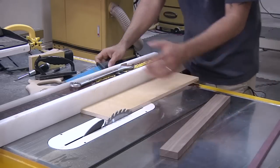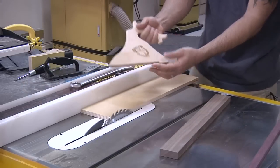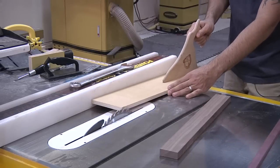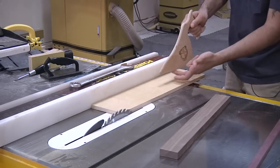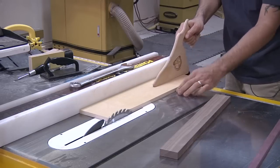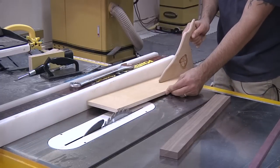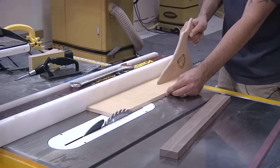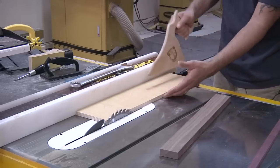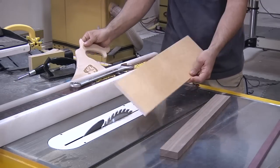That's always a bad idea. Even if you have a push shoe — frankly, this is one that I sell on my website, it's got my face on it — this one is much better. You can still push down if you're not careful, but because of the forward-facing design, there's a lot of pressure at this point and it's much safer to push through. But you still run a little bit of a risk and you don't have much side-to-side control. You only have this little hook on the back controlling the work piece, so it's not absolutely ideal. We can certainly do better.